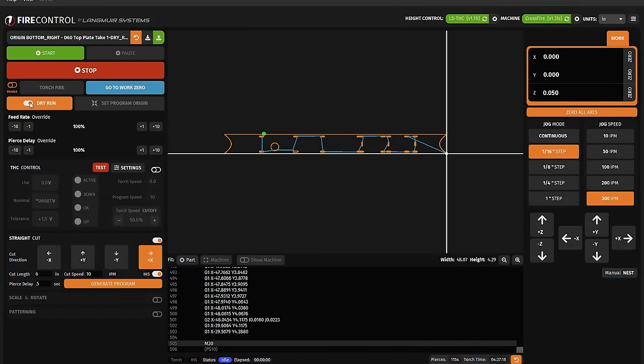We need to build two lowers and an upper right here on top of the diff. It's going to be a three-link, and we're going to be able to use the crossmember that's already in the Jeep — pretty convenient. I'm going to start with the upper control arm mount, building it as low profile as I can so we don't have any interference up top. For time's sake, I'm going to go ahead and not do much filming when building the control arms — we can come back to them and talk about them afterwards. This thing came out good — I'm really happy with it. Let's get to work.